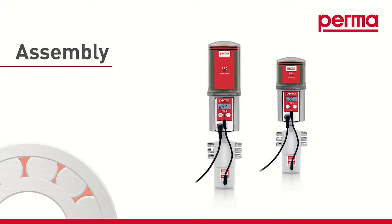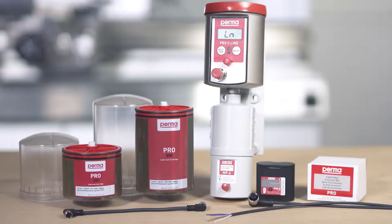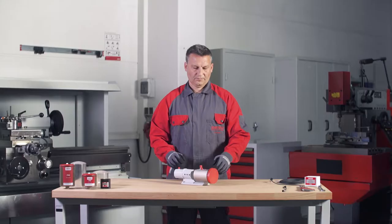Assembly. For operation of the device, you will need a Perma Pro C line basic system, including the Pro MP6 connecting cable, the Pro B battery, and the connecting cable for the power supply or system controls. You will also need a Pro LC250 or Pro LC500 with lubricant, and the reusable cover for the Pro LC.